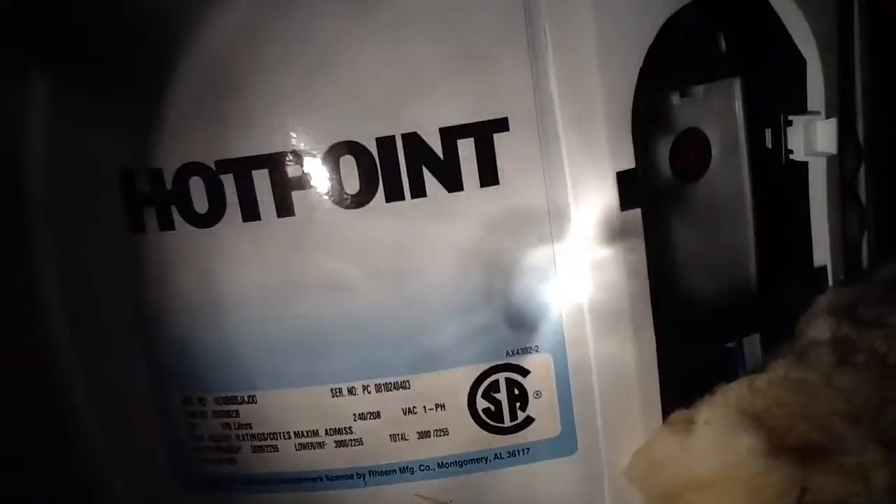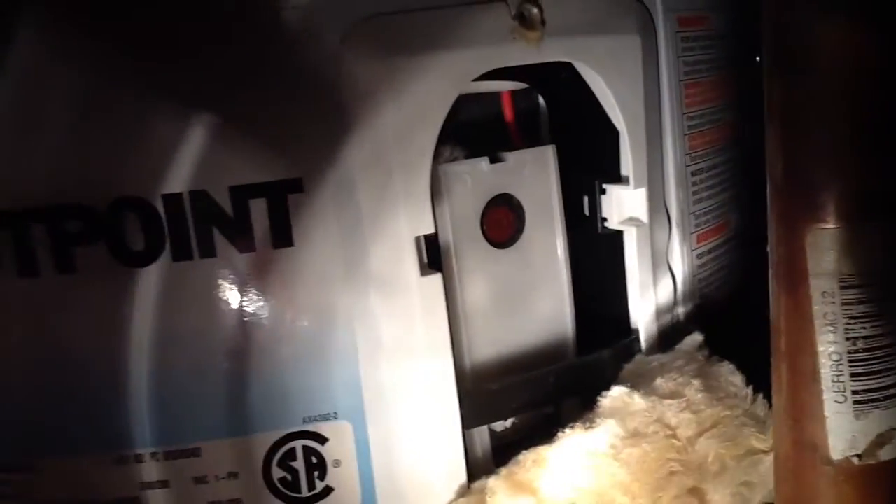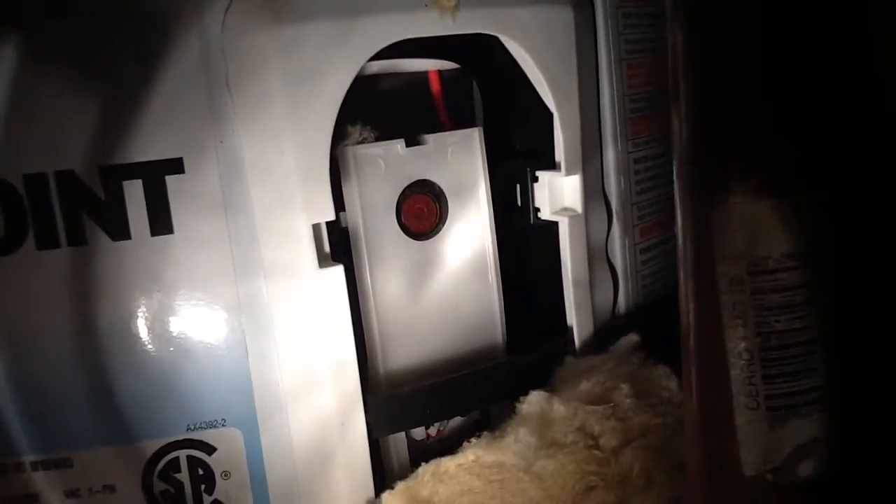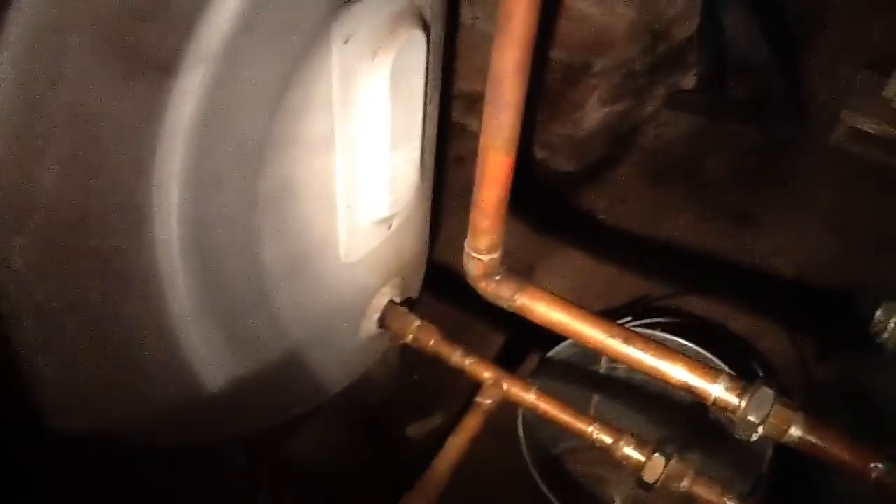For the record, I think I figured out the issue. My hot water heater wasn't working because the emergency shut-off went. There must be a high-temperature alarm on this unit which triggers a reset button to pop. I think what happened is it got over-temperature because of the wood heat and that reset button popped. I hadn't seen that before. I think that resolved it — the pipes are heating up, so it's drawing power now.